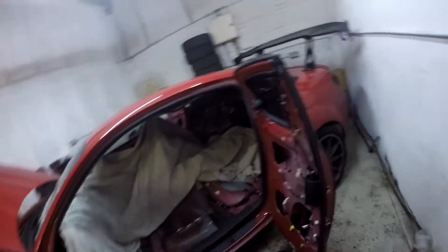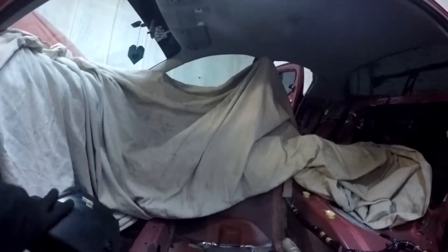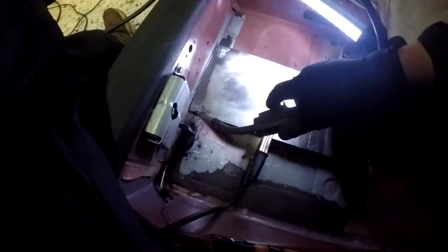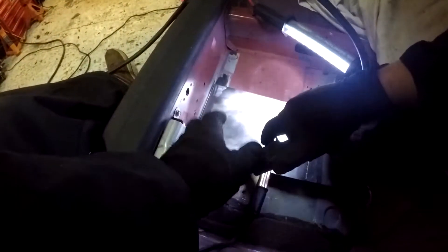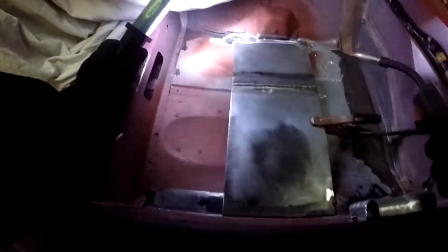Cold, I'm tired, I just want this done. It is perfect — no wobble. Blown through, only a little bit, enough to be annoying. Didn't blow through — woo! Bit of a messy weld but I had to put quite a bit of material down so it wouldn't move, and I didn't put too much heat in the same area. You can see me dancing around — found the corner. Little peaky hole. This is what happens when I get left alone.